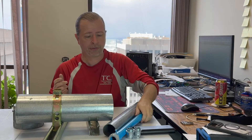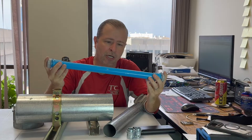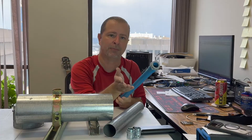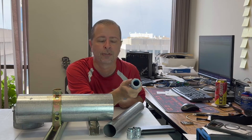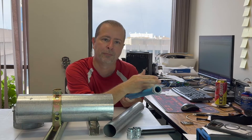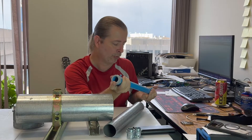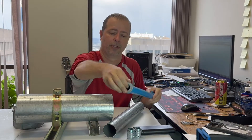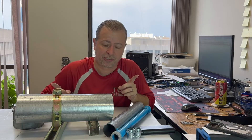That's a nice thing when it comes to pro work — you want to be invisible. EMT is also paintable. I've painted this one because blue meant something at the particular job it's left over from. In some jobs they can be orange, purple, white, green, or blue, indicating different sections of a data center or a different kind of cable — maybe some are multimode, some are single-mode, or some are for fire control systems. You can paint these and it doesn't hurt them one bit.